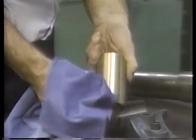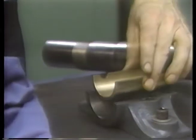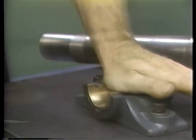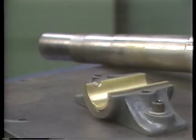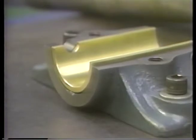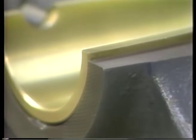And be sure to inspect and clean the back of the bearing and the mating surface in the machine carefully. Dirt under the bearing may reduce clearances and prevent adequate heat transfer. There is usually a dowel, spool, screw, or lug to hold the bearing shell in place and prevent rotation. Also, the edges of the bearing shell are sometimes made to project slightly above the split housing surface.